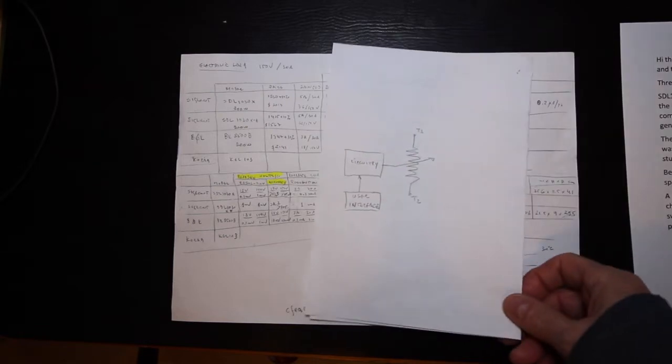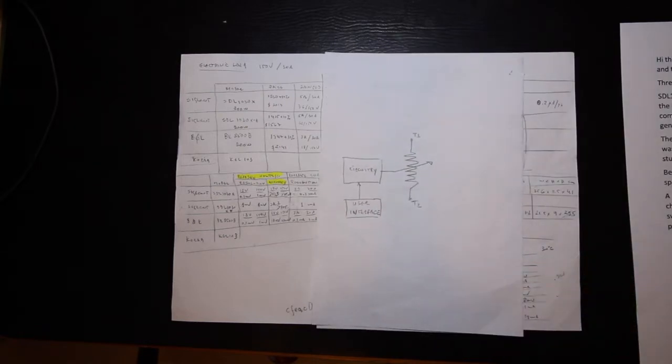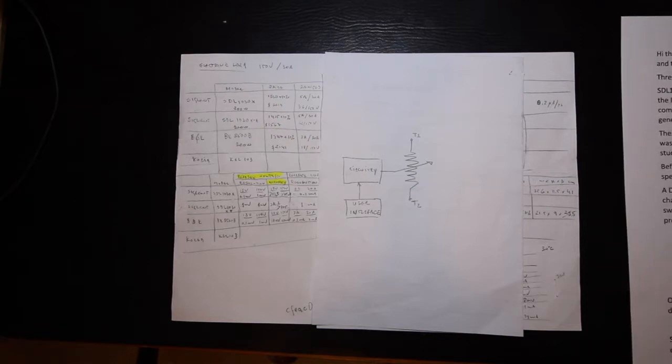Well, before going deeper into this, let's refresh some basic terms used to specify DC electronic loads. A DC electronic load is basically a resistance which can be smoothly changed electronically using a manual interface with buttons and switches, or remotely with the use of commands. They can normally be programmed for constant voltage, constant current, constant resistance, or constant power.